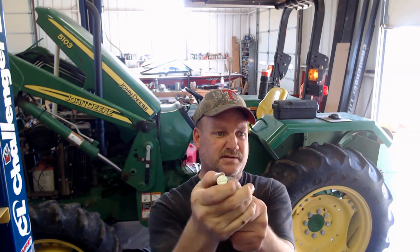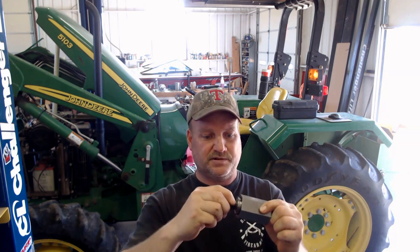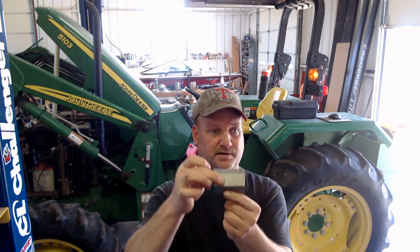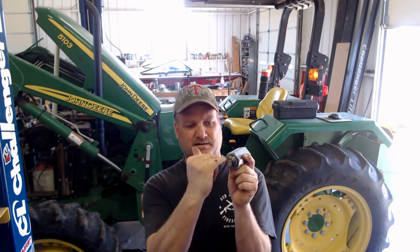See, I've got a piece of this steel in here. You just put it in the collet. I'm sure some of you have used these, but anyway, it's got a nut attached that tightens that collet down real tight. You put that in your mill vise, so you just figure out what you need. In this case, this is 3/4 stock, so that's 6/8, right? We need a 5/8. That's taking 1/8 off material. That ain't much. So basically, I took about 56-57 thousandths off of each side.